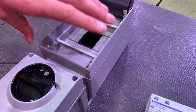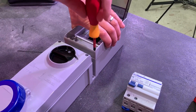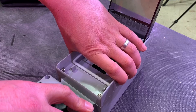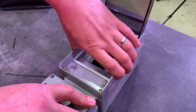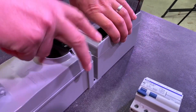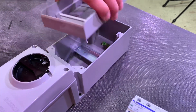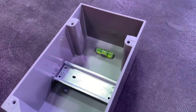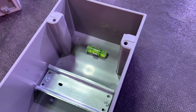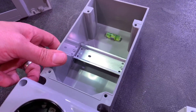So you're undoing this enclosure. The other challenge there, Gary: you've described an RCD, but back at the distribution board you have to combine it with overcurrent protection as well, which means you need a combination of RCD and MCB - and try getting that in something that fits in a three-phase board; you're into very large and quite expensive units. Let's get the enclosure open. There's a spirit level inside - wonky Joe Robinson will be pleased to see that. And obviously we've got our ability to just pop things onto the DIN rail.